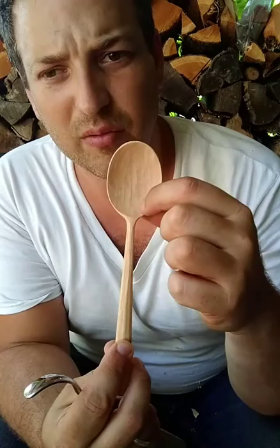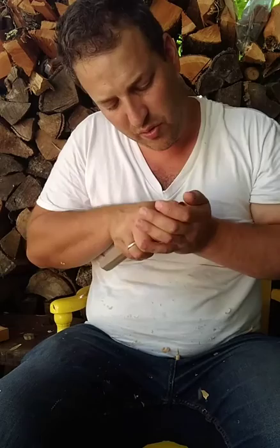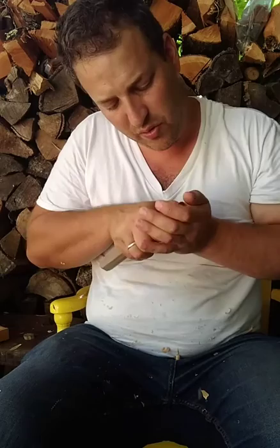Just a little bit back here. The two places where it's easy to not cut enough are right here at the front and right back here. Those are the areas where it's easy to under-carve your spoon bowl, and you end up sometimes with a little bump. I see in people's spoons where they just needed to take three to five more cuts than they did.